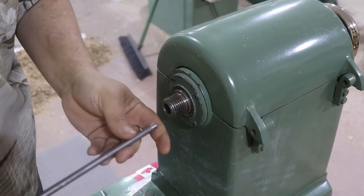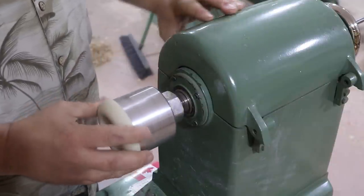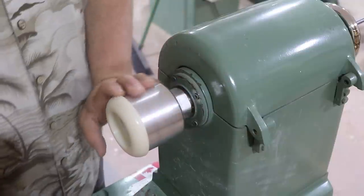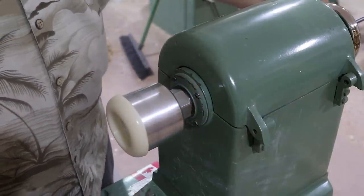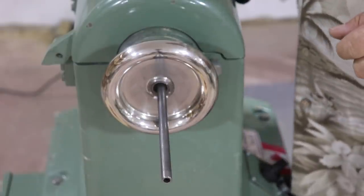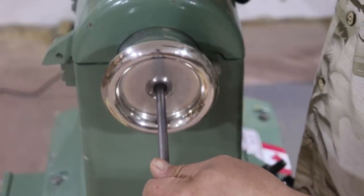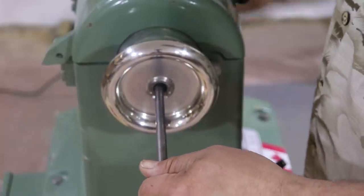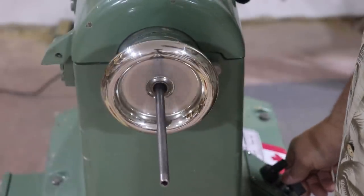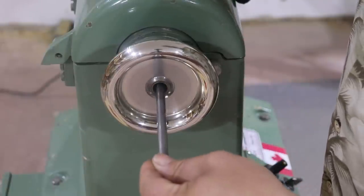The way this works: you insert the shaft through your hollow headstock and the vacuum chuck head threads onto the headstock. Once that's on, you can look at the other end where the hookup goes. The headstock turns while this end stays still because of the bearing inside the chuck head. But my concern is that when you turn it on, even though this isn't supposed to turn, there's really nothing to keep it from rattling.